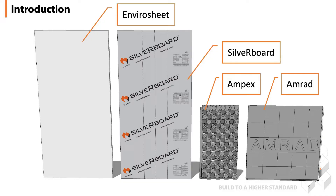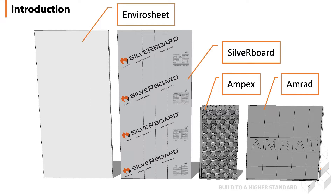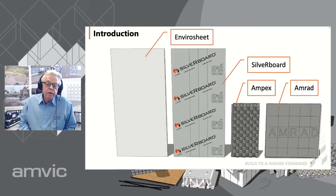AMVIC has a wide range of products that can be used for under-slab application. Starting on the left is EnviroSheet, which comes as a rigid sheet insulation board — it is plain high-density foam. Silverboard takes the EnviroSheet and adds a plastic film on each side giving it additional strength as well as vapor-resistant properties. The smallest member of the family is Ampex, which comes as a 2x4 fully molded panel with a unique pattern for hydronic application. On the right is Amrad, our newest addition — a 4x4 panel also fully molded with integrated film similar to Ampex, but with a geometric pattern on the bottom designed to be part of a radon mitigation system. All of these products come as type 2 foam or higher, referred to as high density for ease of understanding.